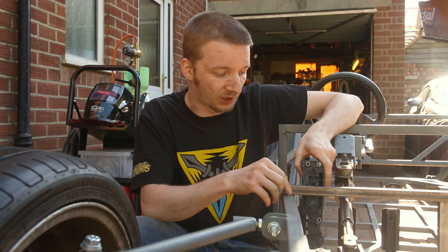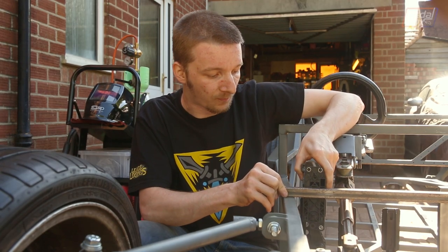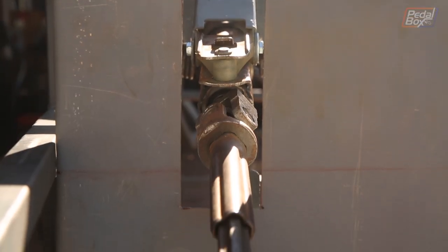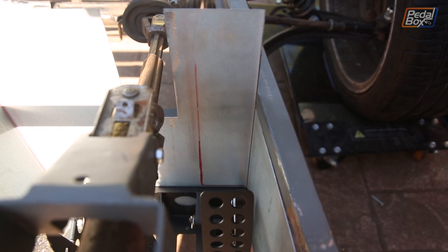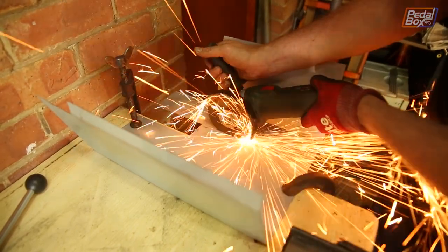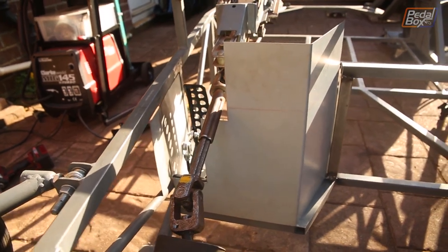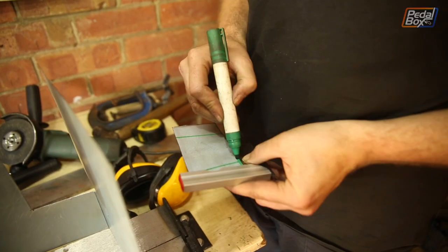The optimisation problem we have is how much we need to move our bulkhead forward to accommodate the pedal. We cut a notch out of our new sheet metal and fitted the steering column so we could clear and surround it, then measured up the space needed for our electronic throttle pedal enclosure. After slightly modifying the firewall, we put it back in the chassis and then cut out the last few panels needed to box it all in completely.